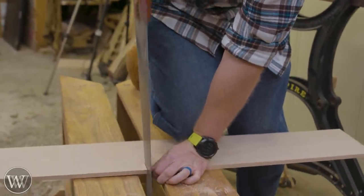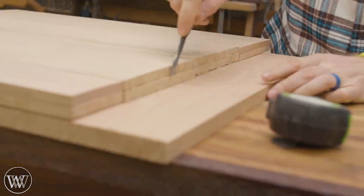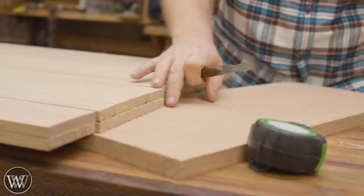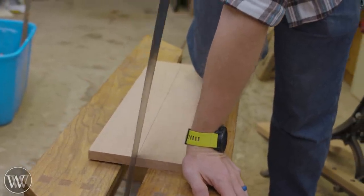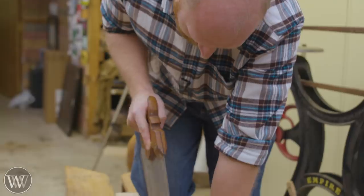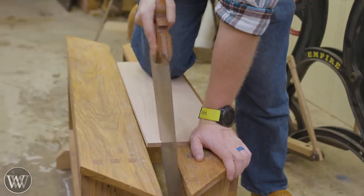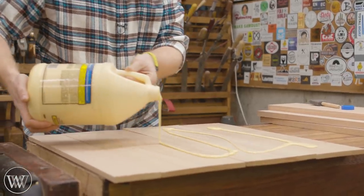Rather than making it out of a bunch of thin plies, I'm going to make it out of three larger plies — half-inch thick and a three-quarter-inch core. It might have a little bit of expansion and contraction issue in the future, but probably not much of anything significant as it's fairly well held together. The maximum size is 24 inches, so it'll be a 24-by-24-inch square, meaning all boards need to be 24 inches long.